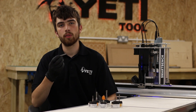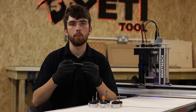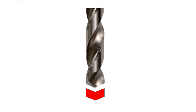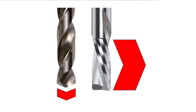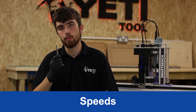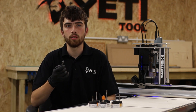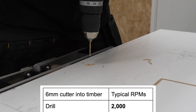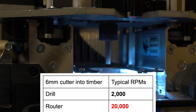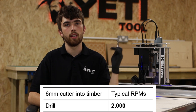To better illustrate some of the features of the router cutter, let's compare it to the more commonly known tool, the drill bit. The primary difference is that the drill bit only has to cut on the end of the tool, whereas a router bit has a cutting action up the entire length. A router bit spins much faster than a drill bit as well, so it has to be much more well balanced. To give you an idea of how much faster: the average cordless drill spins at between 1,500 and 2,000 rpm, whereas a 6mm router bit will spin at 20,000 rpm. For that reason it's important that you only ever use a proper well-balanced router bit in the spindle motor.